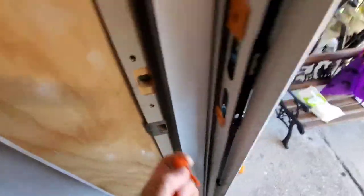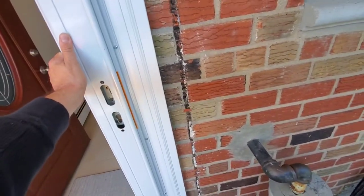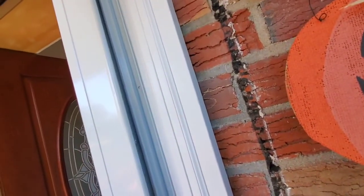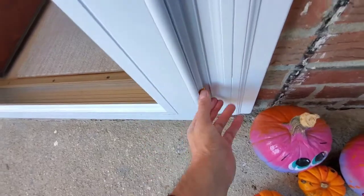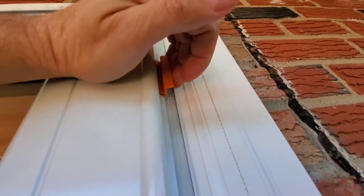You pop these over here — it says to grab the door and pull it. Let's see how this works. Something is grabbing here, let's push these down. I think I clipped in — there we go, you've got to clip them out, bend them back towards you and clip them out. A little difficult with one hand. Victory! When the clips are close, grab it really hard and pull it back — that's how it unclips from the back of the frame and opens.